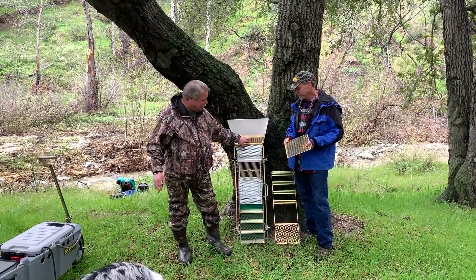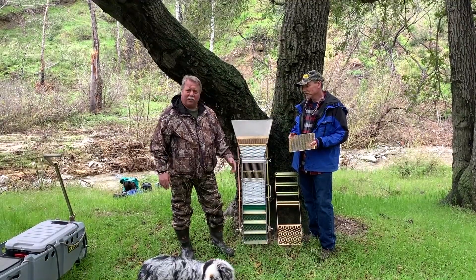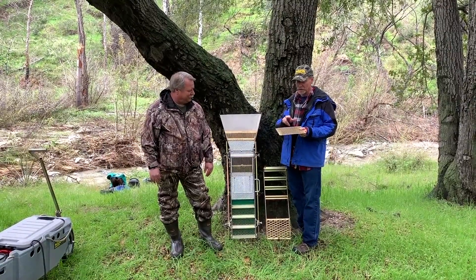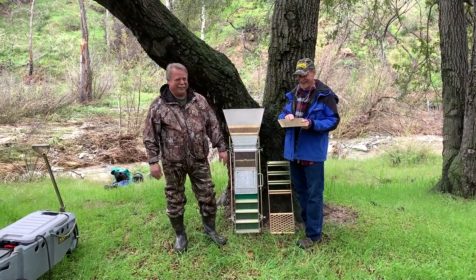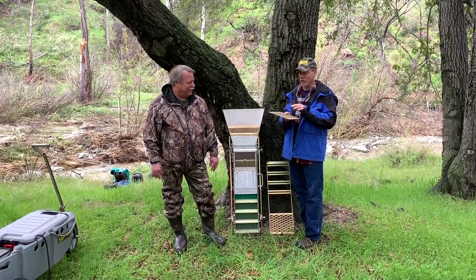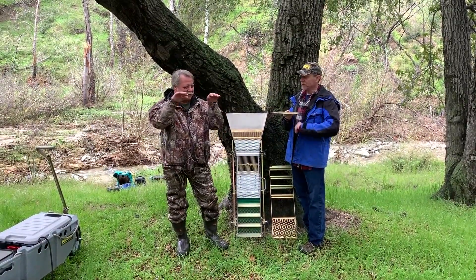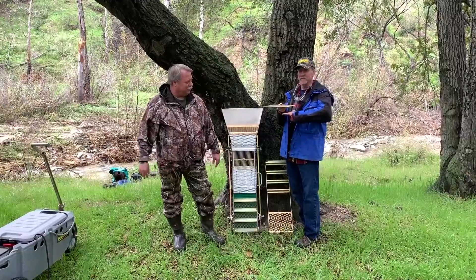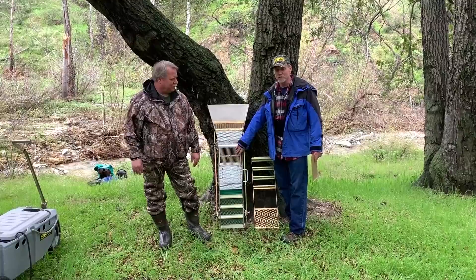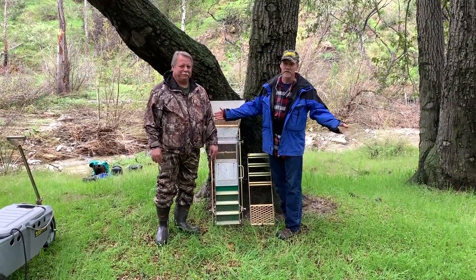All you need is a 12-inch pan and a good digging trowel and a shovel. Pat and I actually have a bet — he thinks the grizzly bar is going to work better and I think woven wire. I'm actually hoping the woven wire works better because with the woven wire it creates so much drag on the material that everything stalls and falls through it. It forces everything downward and the water speed underneath it is really slow. My only concern about the grizzly is that the water speed doesn't go too fast, but that's what we're here to test today.